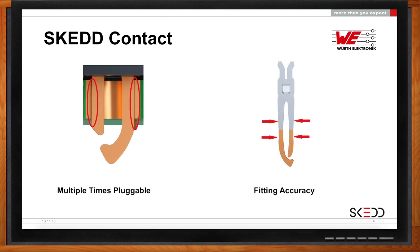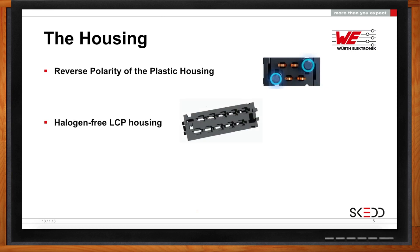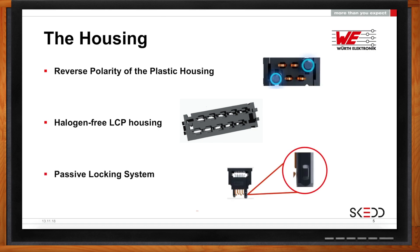The material keeps a consistent pressure on the sidewalls of the via all the way through the connection — it's a connection of the entire via inside the PCB board. To prevent misalignment when plugging in, there are plastic pegs on the bottom interface of the connector in two different diameters, providing polarization. The plastic housing material is LCP, which is halogen-free and capable of withstanding the glow wire test for safety. The plastic pegs also have little barbs to hold the connector in place, so you won't plug it in backward or miss by one pin.